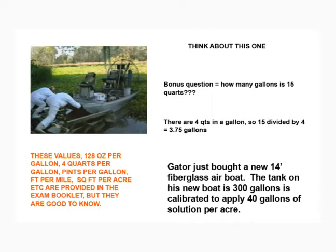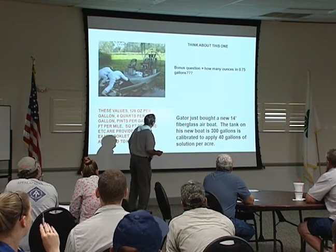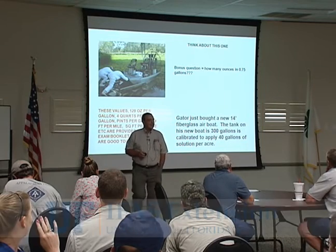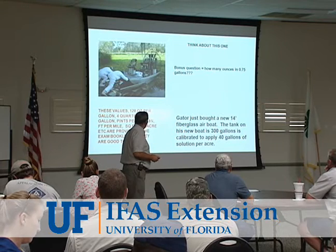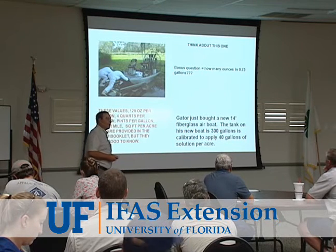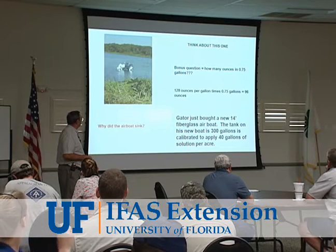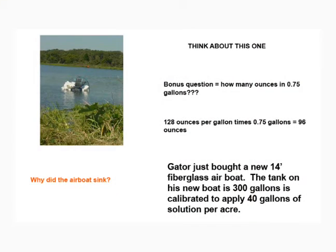So do you take that last quart, and how do you work it out? How many ounces in 0.75 gallons? Well, you'd go back to your 128 ounces per gallon and multiply by 0.75. 96 ounces. So that's what you put in your cup. Now, my cup only measures 64 ounces at a time, so I have to put 64 in and then add the other 32.